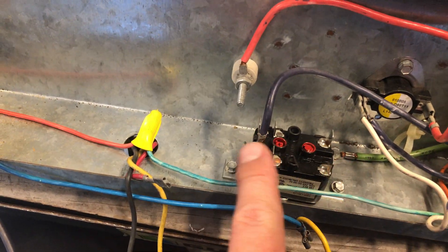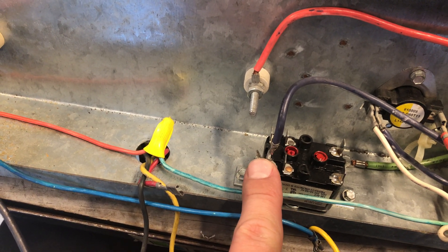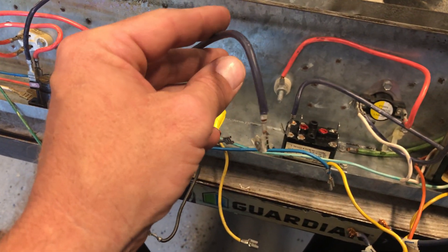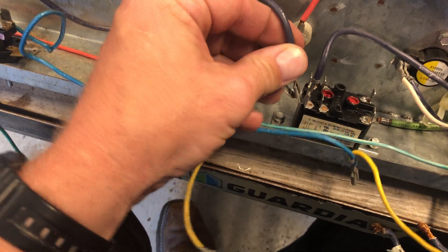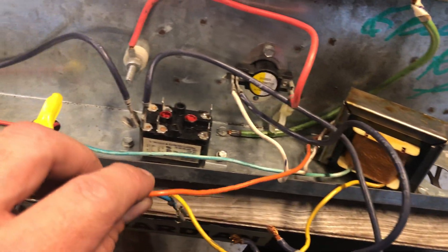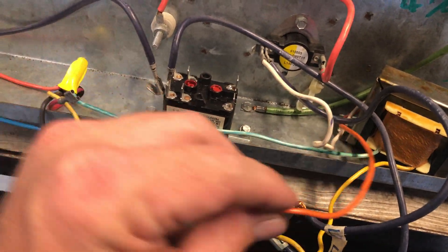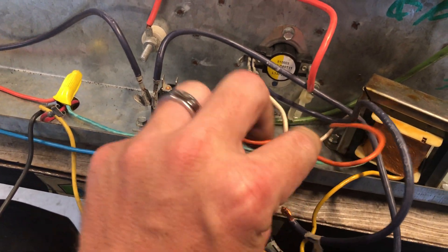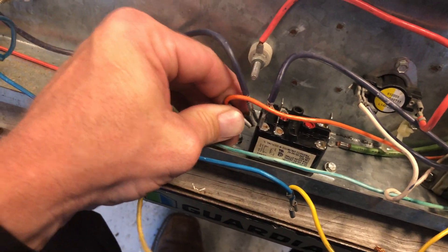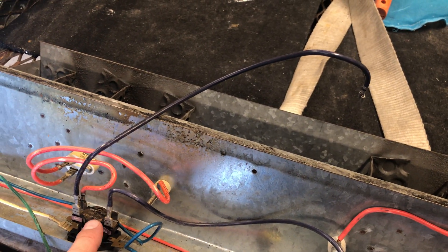You're also going to need to send voltage — 240 volts. One leg of it needs to go to your sequencer. You have this little beauty right here that jumps across, so we'll go ahead and plug it back on here. Then you're going to need to power your transformer. The transformer is 240 volt in, 24 volt out, so we'll go ahead and plug that right over here.